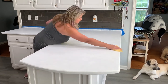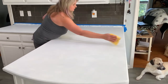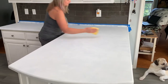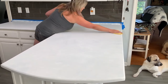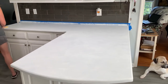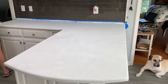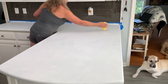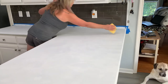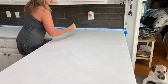You notice she's going in just one direction — she's not going back and forth. The reason you don't want to go back and forth is because if dust builds up on one side and doesn't stick to the cloth, you'll just push it to one side, and when you go back the other way, you'll leave it in a pile you won't even see. So she's going to try to go the complete distance from one end to the other.